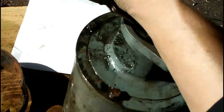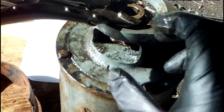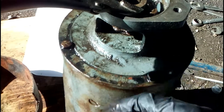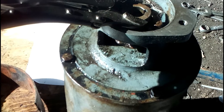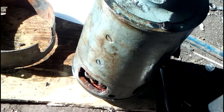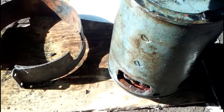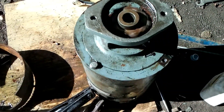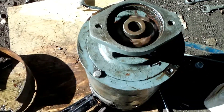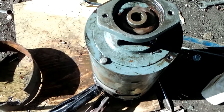I'm trying to see if I can get this motor completely unseized. It was completely seized; now it's turning but not all the way yet. I figure the bearings are dirty, maybe rust. I'm going to see if I can get it to go all the way around. I've got it running on 12 volts right now with no controller.